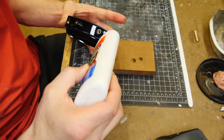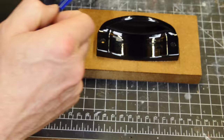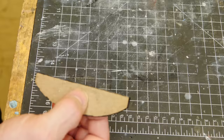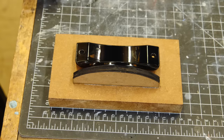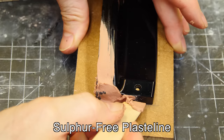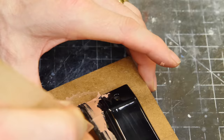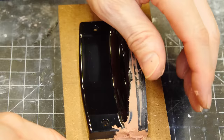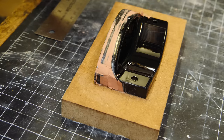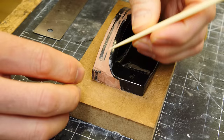Let's use some more of that white PVA school glue to glue our part down. It's a non-destructive glue, easily removable, but just strong enough to hold the part in place during the casting process. Let's take those spacers and glue those down to our base as well in the back of the chin rest. I'm applying some of Chavant's non-sulfur based modeling clay here to seal up the gap between the part and the spacers in the back. I heat the clay up so that it becomes soft and pliable. Once it's cooled I can go back with wooden and plastic tools and carve it into the shape I want. I need to get a really nice clean edge along the part so that I can get a good parting line in my mold.